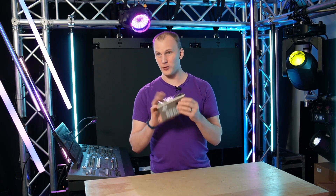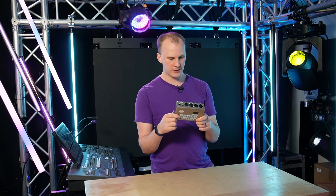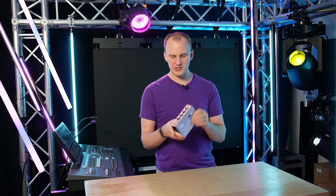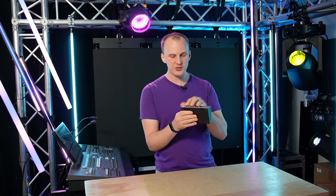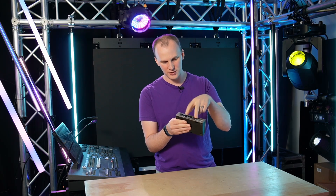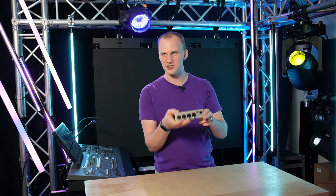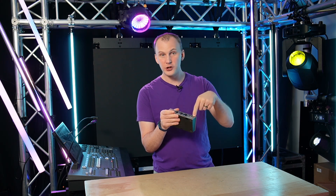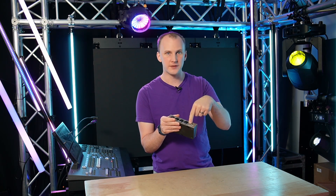A little less than a year ago, MyDMX5 was announced and this piece of hardware came out. This is the box you get when you purchase it. From a hardware perspective, this is really cool because you get four DMX outputs. It comes with two universes, so you get two three-pin and two five-pin connectors for each output. You can hook it up via USB to your Mac or PC, or over network — you just need to power it via USB-C.